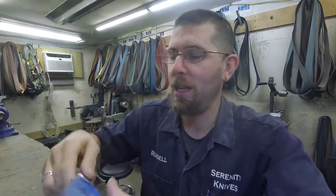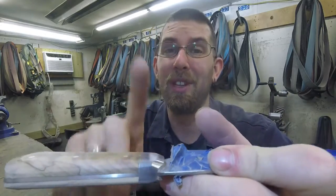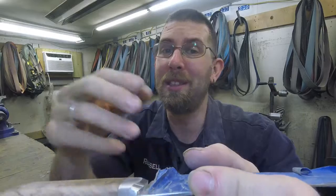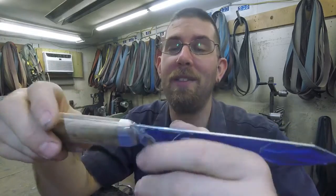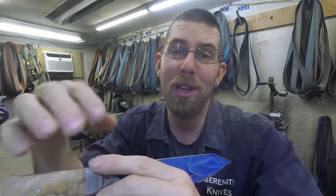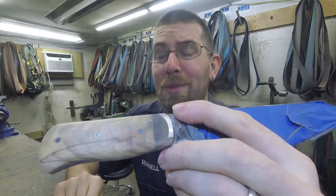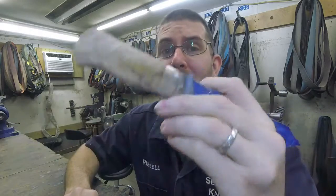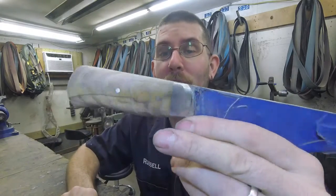What happened is that when you're grinding on 304, this bolster material, it gets really hot really quickly. And when you're only doing four knives, it basically gets so hot you don't want to work on them anymore. And I don't like dunking knives at this stage in water. It won't hurt them, I just don't like doing it. So I grabbed the other three, and so I worked on all seven of them, or eight of them, all the way through. So they're all at the same stage still, which is cool, and I should be able to get these all the way through to hand sanding now, and start some Kydex production for these as well.